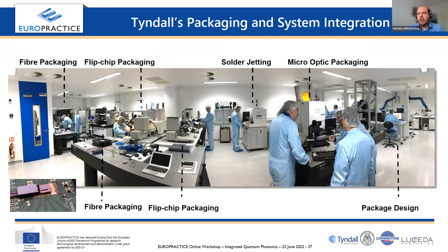Other things we need to think about is how to make electrical contact with the chip. If I want to drive the chip or control what's happening on it electrically, this would involve some sort of wire bonding or perhaps flip chip technology. Thinking about compatibility with these machines from the start saves designers a lot of time, money, and effort. That's also why we've got a design packaging tool in the lab — to remind people that keeping packaging in mind from the very start helps optimize everything.